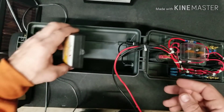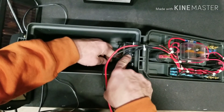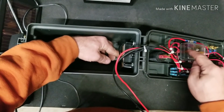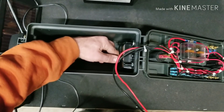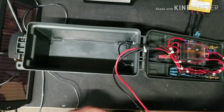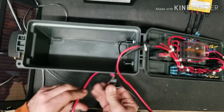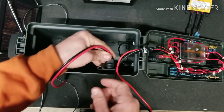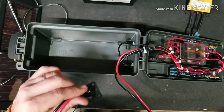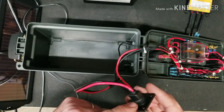To have a nice easy spot for the controller to mount out of the way, we are going to mount it just under the two LEDs by drilling a hole through the side, and in this instance I'm going to use pop rivets. You can use the same screws that were used to mount your fuse block if you wish. The exterior waterproof port is going to mount in this corner here, and we'll use the same three-quarter inch drill bit used for all the switches. There will be a little bit of trimming needed with an exacto knife to get it to fit snugly.